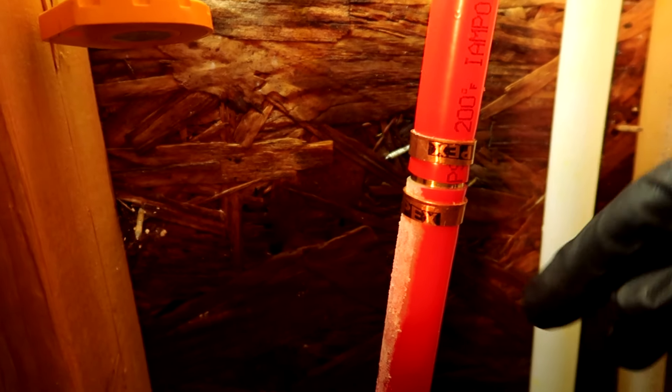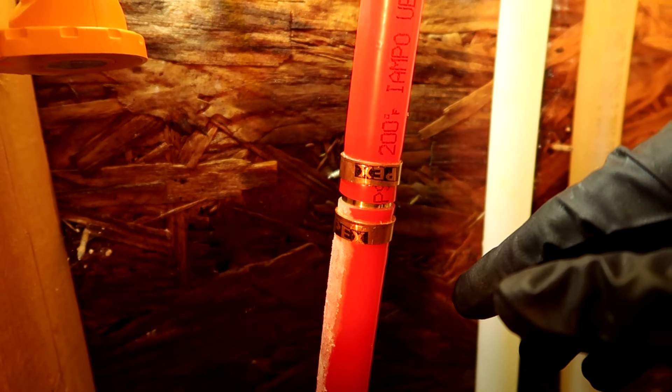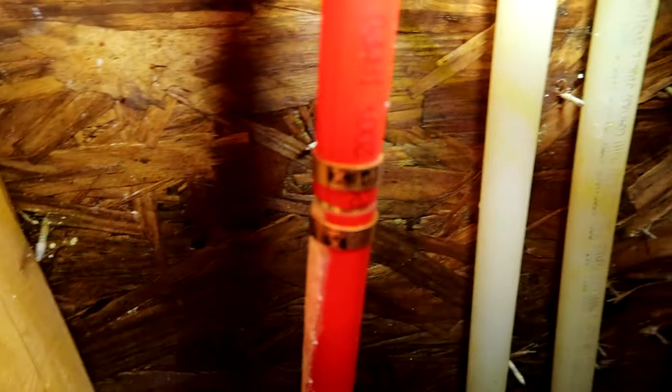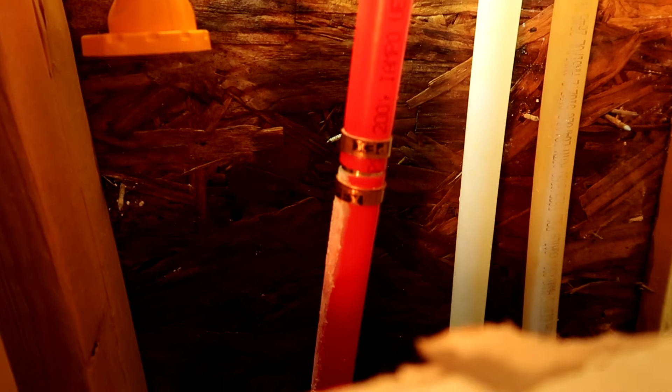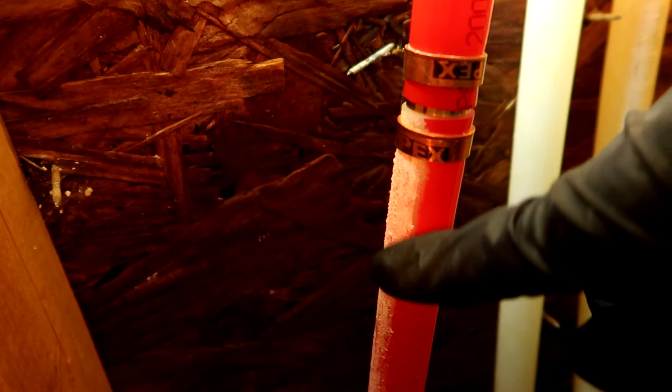That's how I fix them. You can do shark bite if you want - I'm not going to talk smack about it - but this is how I was taught to fix PEX. It's not dripping, so we're going to leave it open for a few days to let it dry out. It's kind of wet but I don't really see any mold - surprising. I think most of it went outside. We let the hot water run for about five minutes - pipe is nice and hot. Give it the old dry glove treatment - still dry. That thing's been leaking a long time - that's some calcium buildup.